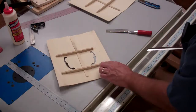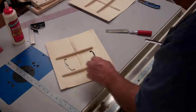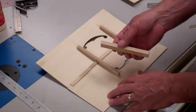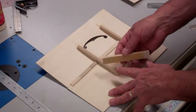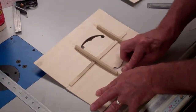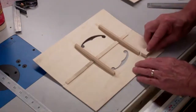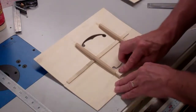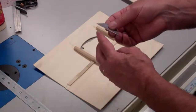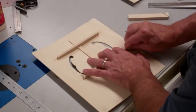And we'll clean this up with some sandpaper, and we want to get this nice and flush down to the top. To show you the technique I've been using, here's a piece of scrap wood with some 100 or 80 grit sandpaper, and get down pretty close, and there'll be some glue left. And I find I'll use my razor with the edge bent over.